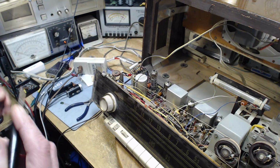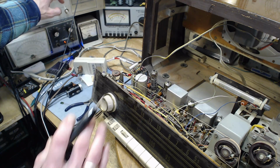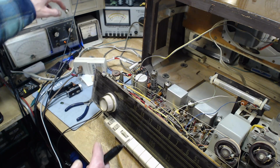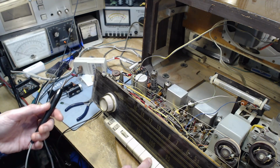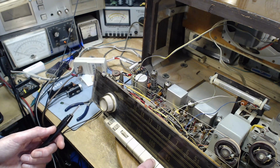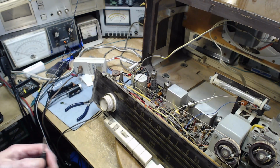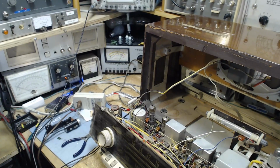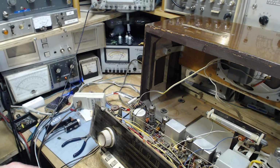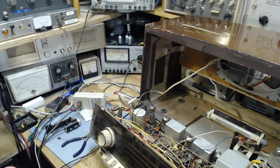Okay, so we're going to turn the radio on. Now, if there's no B plus and there's some reason for it, that reason could be getting hot. Well, I don't know though. Didn't notice anything yesterday. We'll put it on broadcast here. There we go. You kind of missed it, but the dim bulbs jumped up and went down pretty quick. That's a good sign. This is the big filter capacitor. It's probably okay.